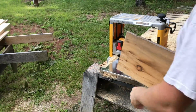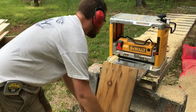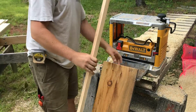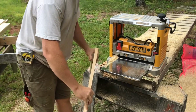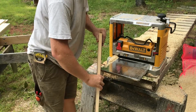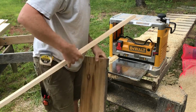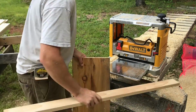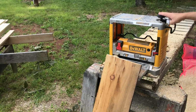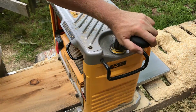Finally, when you're homesteading, you sometimes get called away from a project before you can finish it, and it can sometimes be quite a while before you return. If you'll need to plane again another day, it's a good idea to have a story stick that is the finished thickness of your project. That way, when you come back to the project and you need to plane some rough lumber from scratch, you'll know how thick the finished piece needs to be, and you can count back the number of turns you raise the planer deck to get the lumber through for the first pass.